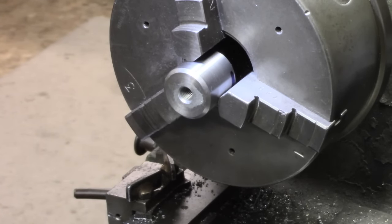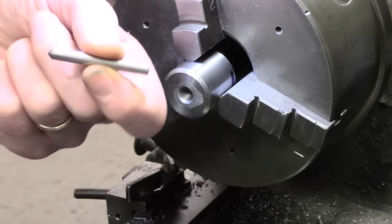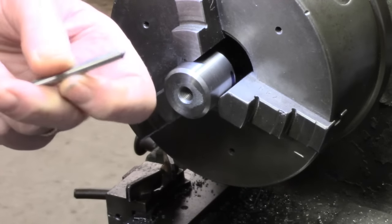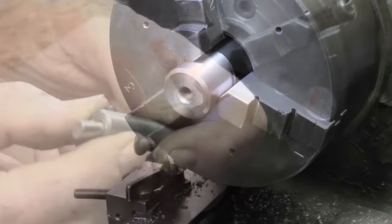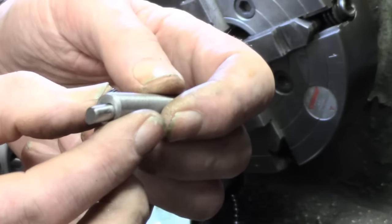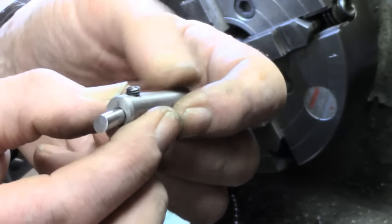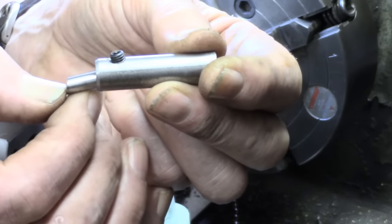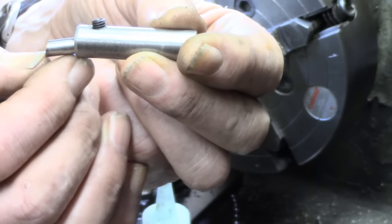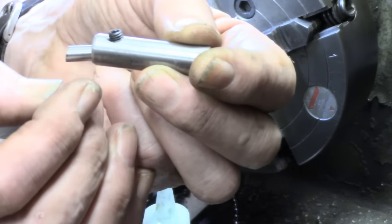Out of all that stuff that I got, which I showed you in a previous clip, I got some nice convenient pieces of quarter. So I'm going to grind an end for the new tool, and then we'll set up the ball turner, hopefully, if nothing else comes up in between. Okay, here's a piece of quarter. Tool steel there, we've ground that. And we're fairly neutral there with regards to the angle. It's probably about 1 or 2 degrees back rake there. So we're going to try that, set that up.